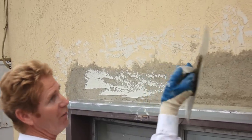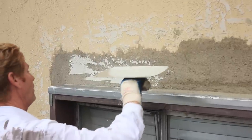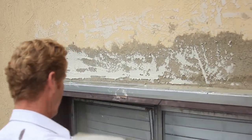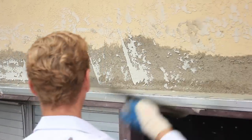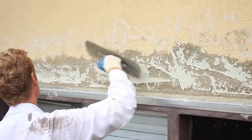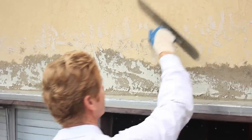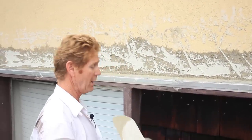Now I'm looking at what they've done — the original plasterers were right-handed, coming upward like this, putting the first one on then pulling it sideways. So I'll generally do something very similar: I'll start at the bottom here and pull it sideways. Sometimes I'll just take my trowel and put a couple of sideways ones, like I see they did. I could switch to a square trowel if I wish but I don't need to — I can use this swimming pool trowel. Give me five minutes to take this whole wall and then I'll show you how we knock it down.